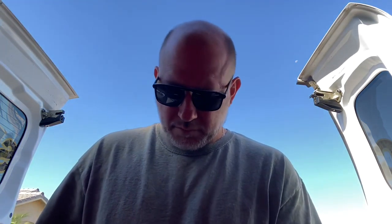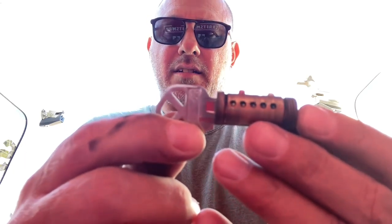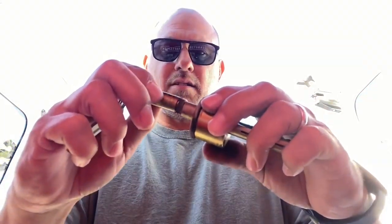We put the old key back in here — anyways, this is the old key. You can see it's not lined up. The pins are down past the shear line and then you can see them sticking up. So what that does is if it's the wrong key, it does not turn in the cylinder. When you put the correct key in, it makes it nice and smooth. Put it back together, works nice and smooth. You put the old key in there — doesn't do nothing. Anyways, that's the process of re-keying the locks.